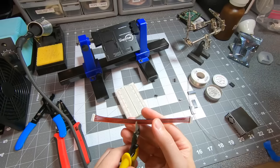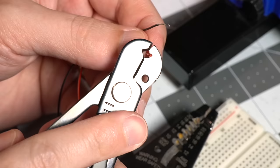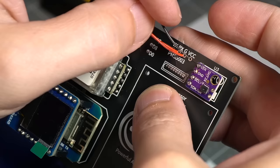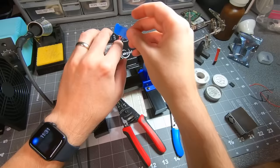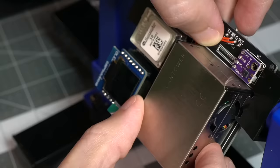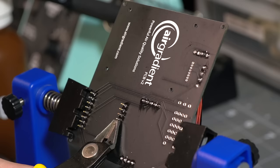For the Plantower PM2.5 sensor, the installation is a bit finicky. I had to first cut the wire it came with in half, then strip the ends of four of the wires using the guide on AirGradient's site. I ended up using my adjustable wire stripper for this because it can be a lot more precise — the wires in this cable are tiny and stranded, making them really fragile and prone to pulling out if you use the wrong wire stripper. I stuck the wires into the PCB following AirGradient's instructions and soldered them in place. It helps to put a piece of tape across the tiny wires on the top side, otherwise while you're soldering them they might pull out. Finally, I plugged the other end of the cable into the PM2.5 sensor, put some double-sided tape on it, and stuck it on the board. The final work on the PCB was snipping any long leads with my flush cutter, then cleaning off extra flux from the solder with alcohol.